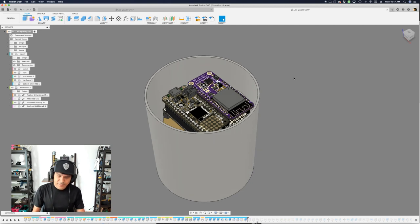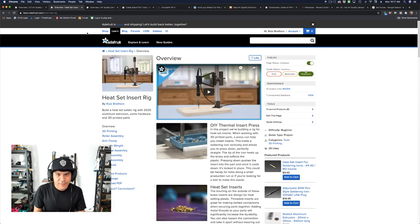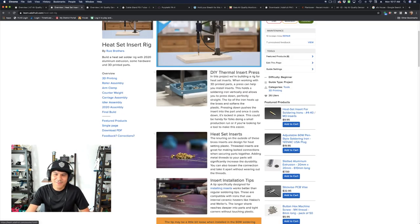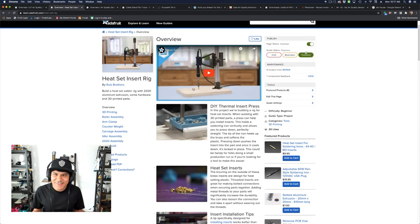If you're going to make a project and need to disassemble it, you don't want the threads to wear out — heat set inserts is definitely the way to go. We've done so many that we created a rig to make the process easier. You can use a soldering iron with a special tip, and the rig lets you smoothly press the iron down into the heat set insert. You can see how it's done in this little gif. Folks are designing their own clamps for their own soldering irons — it's great to see people making it their own. It also walks you through different heat inserts.